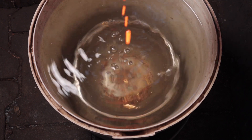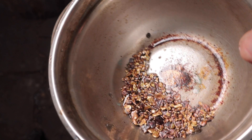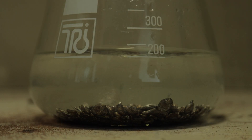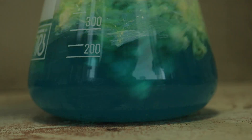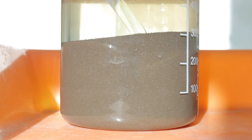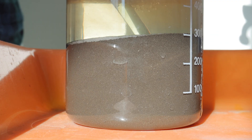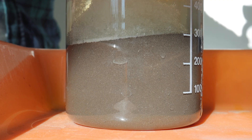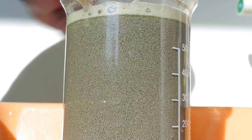So I cast silver pellets again, this time more successfully, and into nitric acid it goes. However, this time I used a different method: hydrochloric acid to get silver chloride, which I turned into silver oxide using household lye. And finally I added sugar to reduce the oxide into silver metal — which is all the fluffy stuff you see.